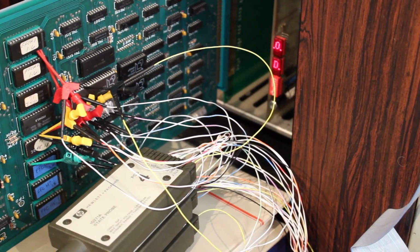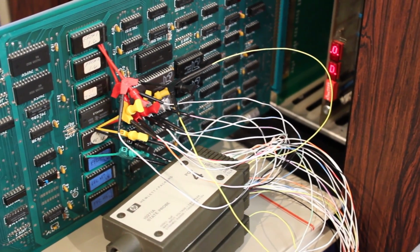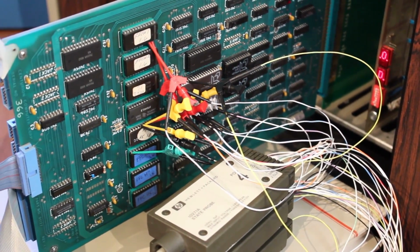So this is really good news because it means that we can essentially just do a read test, let it get stuck in the loop, and then we can start probing around on the FFC card itself, looking for that data. Time to get the oscilloscope out and start probing. So we're gonna have an oscilloscope, a logic analyzer, a riser board. We're doing a lot of specialized stuff in this one, but hey, we're getting there. We're gonna figure out what's wrong with the FFC.